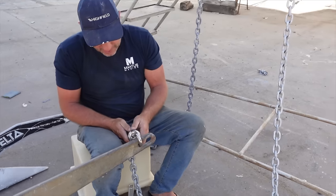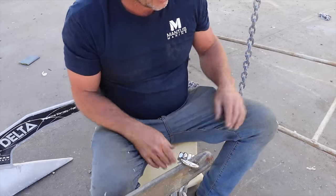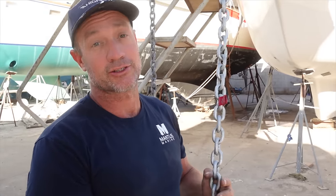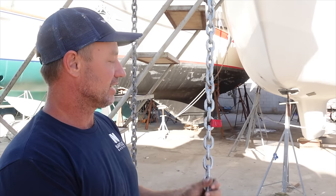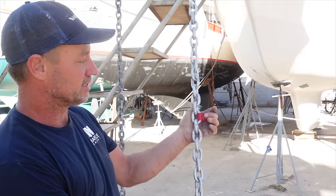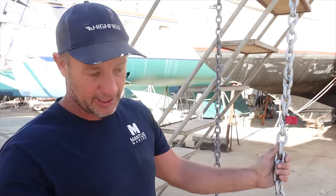I'm probably going to change that over to the wire because I don't like bits that can get caught on things. While we've got the chain out — the other thing we've done is we've regalvanised the chain. It was done in Mexico so we've never done it there before and can't tell you how long it'll last, but we'll let you know. We've done ours in Penang in Asia and it lasted many years — we double dipped it. This one's only had a single dip done in Mexicali. Taj has sewn markers on at every 10 metres so we know how much chain we have out — we don't have an anchor counter. We've got just over 90 metres of chain, which has done us quite fine.